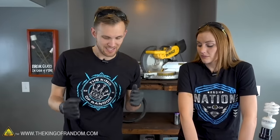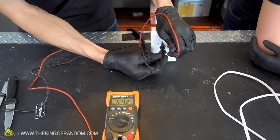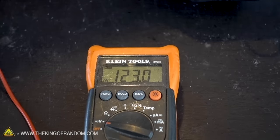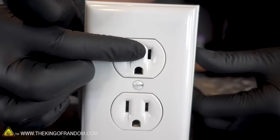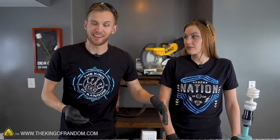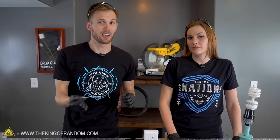So is this something that can happen to you just by sticking a paper clip in the outlet? In the neutral, we get a reading of 123. If we put the lead in the ground, the exact same reading — 123 volts. Is a paper clip going to complete a circuit? Well, it's possible. Here's the thing you have to keep in mind: if the paper clip is in the hot side of the outlet, there is electricity flowing into it, but electricity isn't going to flow unless it can go somewhere. With the neutral and ground, that allows the circuit to complete. If the paper clip is touching nothing, then a circuit's not going anywhere — it's not complete, and electricity is not going to flow through it.